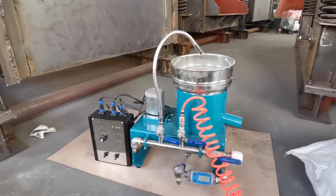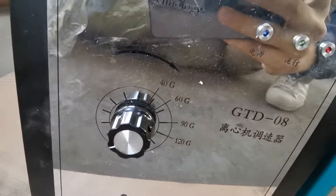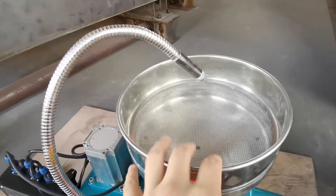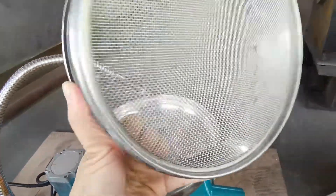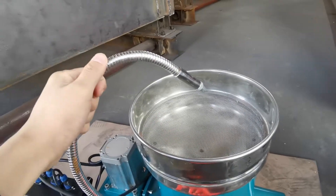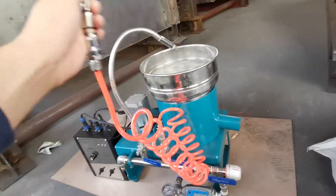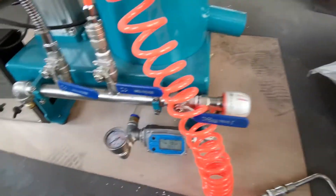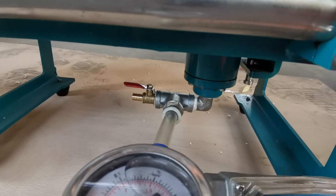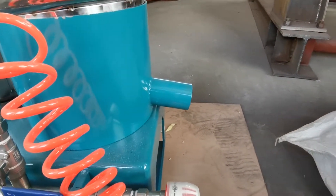It's only 34 kilograms with 40 to 120 gravity force. Here is the screening system with only a two millimeter screen, and this is the washing water pipe. It's a fluidization water pipe. We could check the water pressure here. Concentrates out from the bottom and tailings out from the sides.